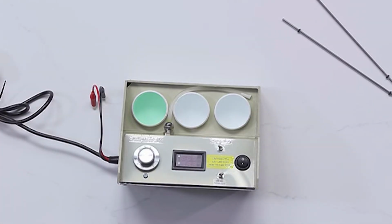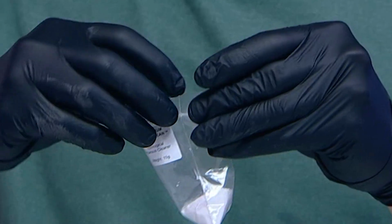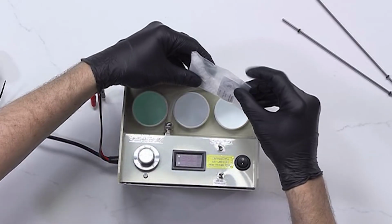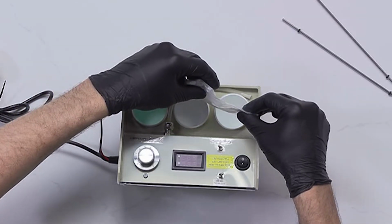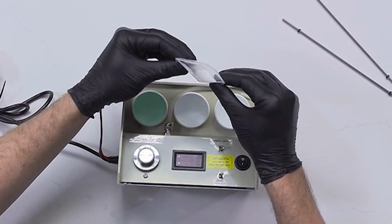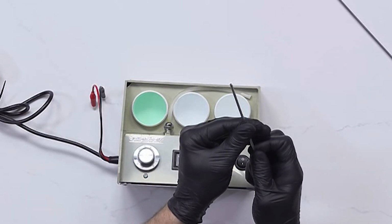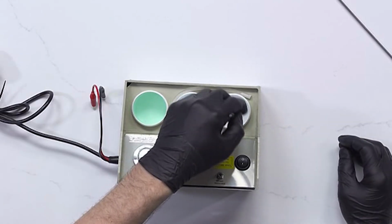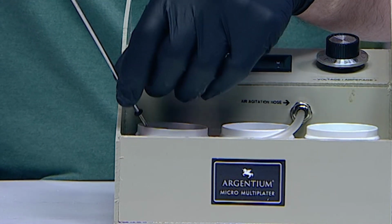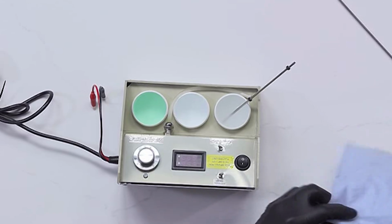Next, we need to take our bag of electrolytic cleaning salts, and we're going to place half of those. Again, it's approximate, the values aren't critical. Half of those into the very left-hand tank. You can use one of your bus bars to stir this. Pull the O-ring back, stir, and when complete, use a piece of kitchen towel or blue roll just to wipe off the bus bar.